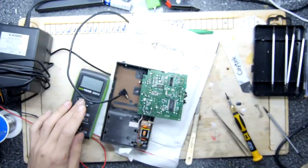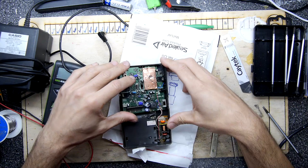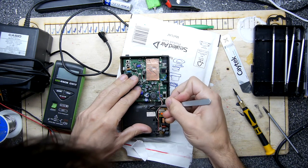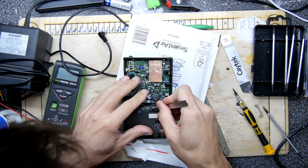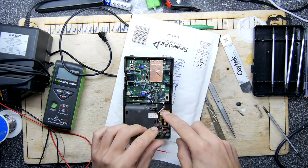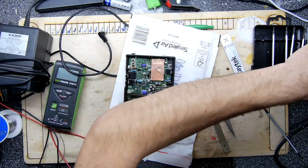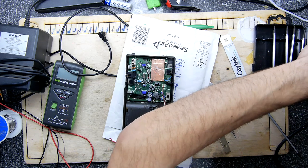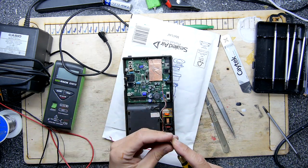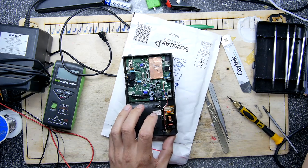So there's one final sanity check for the whole power supply issue, and I'll describe it while I put this all back together. It could be that the power supply is failing. What one can do — without going through all of this pain again — is just put a couple of wires on the end of the jack of the power supply into the battery bay. If it works that way, then you'd know there's some weird conditioning circuitry — but we could see that the battery power goes straight through the same path. So I suspect you could prove whether it's the power supply by going through the battery bay without opening this up.